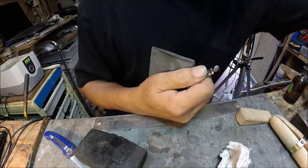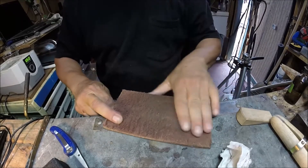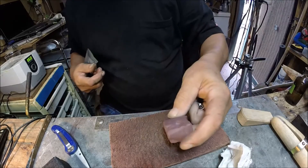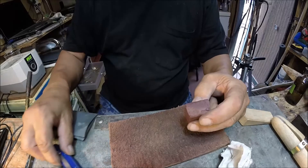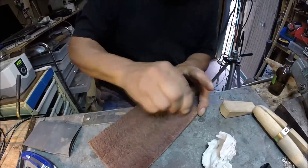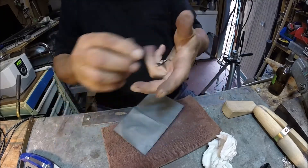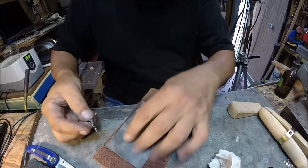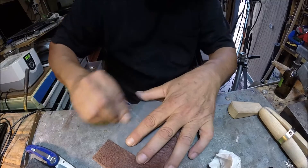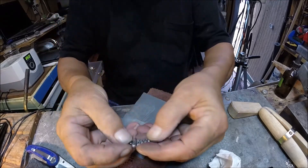Now I'm gonna take my 320 sandpaper. Check this out — I've got this piece of metal and I glued leather to it. One side is the hard side of the leather, the other side is the fluffy side. Then I charge it with jeweler's rouge, which is a type of ground-up clay added to wax. This works just like one of those jeweler's polishing cloths you buy at the store. At this point I'm going to sand it on the sandpaper and just knock off the high points. This is a super-fine paper too — it doesn't leave any marks on the metal.